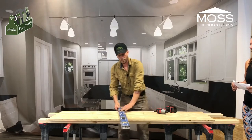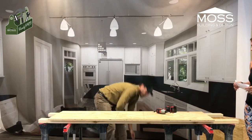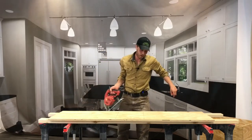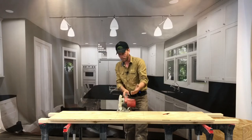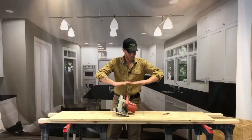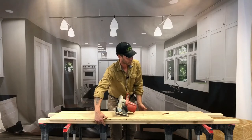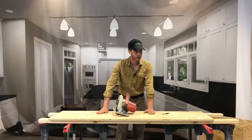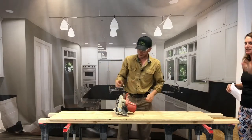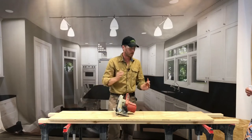Most carpenters have a four-foot and a two-foot level, sometimes a torpedo level, or a longer six-foot level. This is just a freehand cross cut. The bad thing I'm illustrating right now is that I'm cutting in the middle of my saw horses. The only reason this isn't dangerous is because I've got proper support underneath — two-by-fours beneath my plywood. Don't forget to be safe and wear your safety goggles. If the piece of plywood were sitting on the saw horses without support beneath it during a middle cut, that's the most common mistake anybody makes.